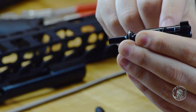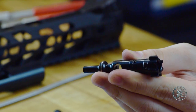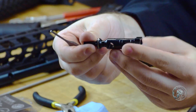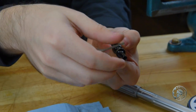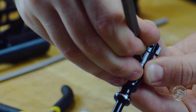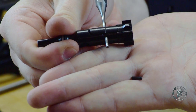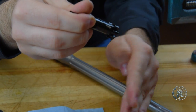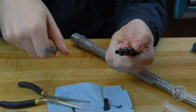In order to do that there's one pin that runs from one side to the other. To do that we're going to use a 3/32" punch. The extractor claw has a little bit of spring pressure on it, so you just want to press down on the back of the extractor claw and then with your punch press on the pin. The pin will pop out and the punch will go through, still holding the extractor claw in place. Go ahead and set the pin to the side and then slowly remove your punch.